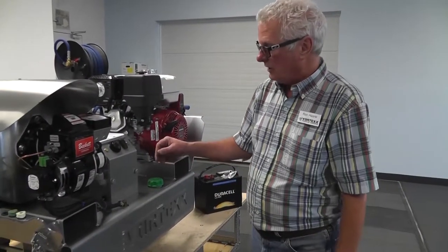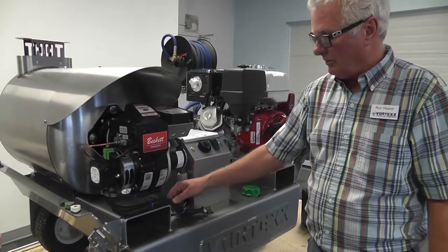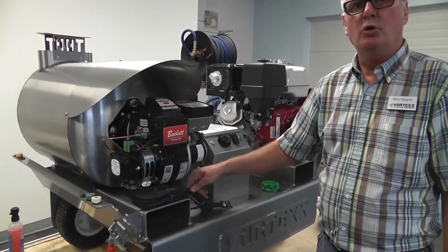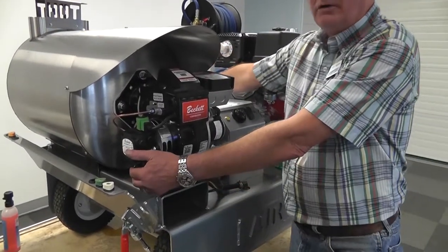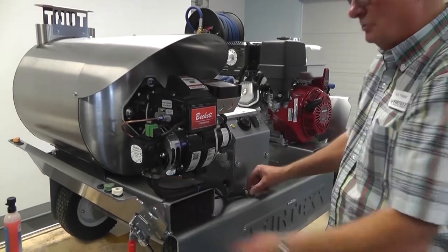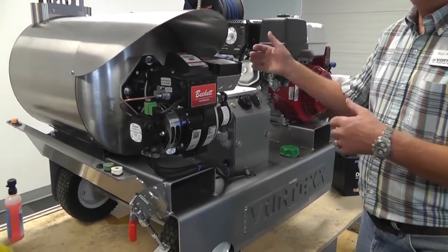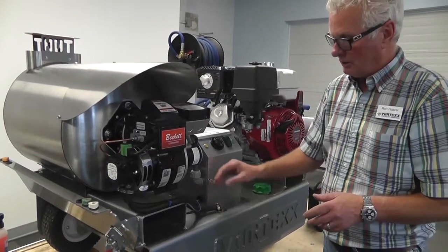One other service thing to watch for: if somebody cuts the hoses with a forklift or these hoses get damaged — these are 3/8 fuel hoses — the fuel hose in the back goes to sucking out of the filter in the tank, and the front fuel hose is a return that goes back into the tank. We separated them so we don't agitate up all the sediment and things in the fuel, which helps the burner run a lot cleaner.